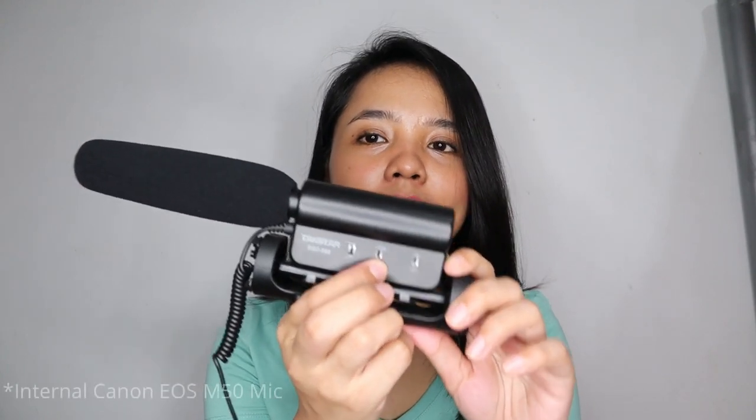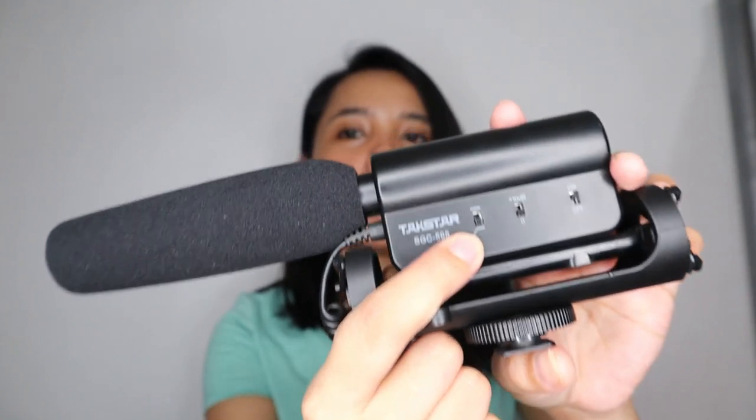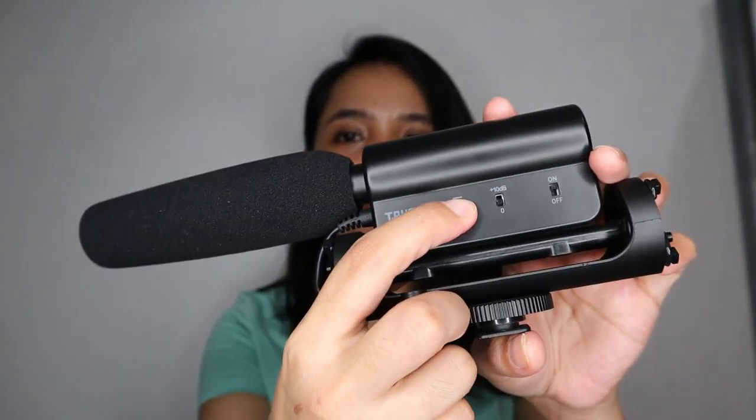It has settings like on/off, plus zero gain or plus 10dB, and an equalizer setting, which is important so you can filter out low-cut frequency and ambient noise. So if you want louder audio, just turn on the plus dB. But the disadvantage is that the ambient noise becomes louder too. So if you want to remove the ambient noise, just set it to zero gain. The equalizer setting is also very important — you can flatten it or turn on the high-pass filter, which means only high frequencies are absorbed by the mic while cutting the low-end frequencies that make your audio sound bad.